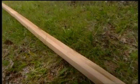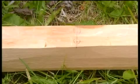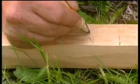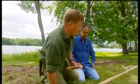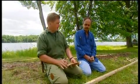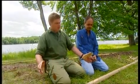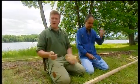It was this characteristic ribbed structure that we needed to think about for ours next. No tape measures, remember, so we used a template to mark up where the ribs should go. Whilst that may seem straightforward enough, you need to know what you're doing. It's really interesting. Although we're very early on in the building stage of the canoe, we're having to make important decisions right now. And the spacing of the ribs determines essentially where the thwarts go. The thwarts are the pieces of wood which spread the canoe above the top. And we have to have enough room that I can actually sit in the canoe and get the load in the canoe.